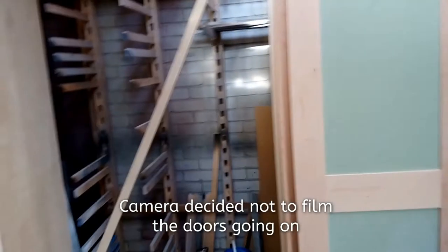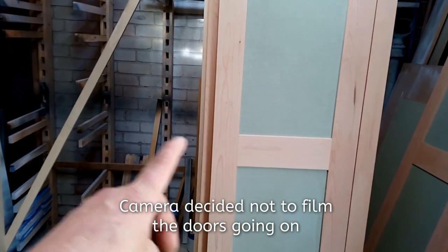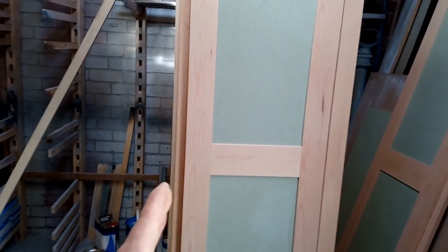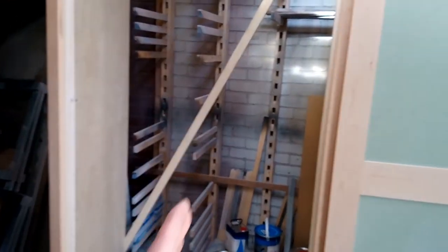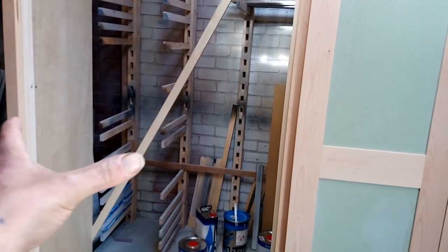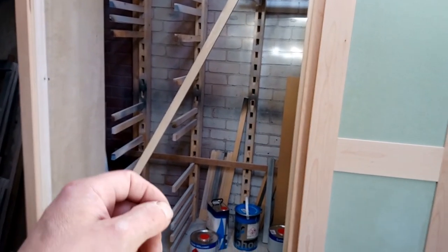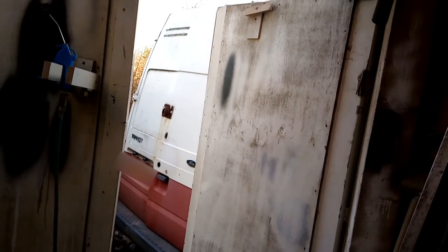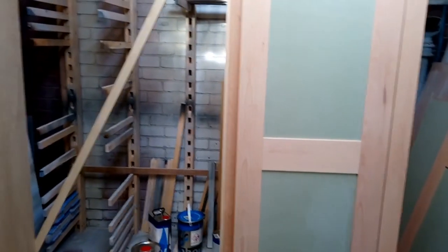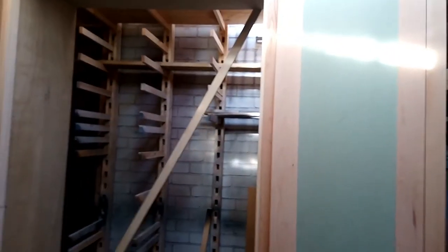I'll put the top one on, hang it and then swing the other ones in. I might have to just lift the door a little bit because it'll sag on that top hinge, but I'll lift them so they line up with the lines I'm putting on. That's where the screws are going to fit, so I'll fit the others. When I hang that one it'll pull that centre divider something like straight, so I can fit that door up to that then. These two should go fairly easily — I know they're probably going to bang in the middle. I made that too big, so these two will be fractionally too big — only 5mm though. The hardest work's done, the machine's set up, little jigs cut, one's hanging — should fly through the other ones.